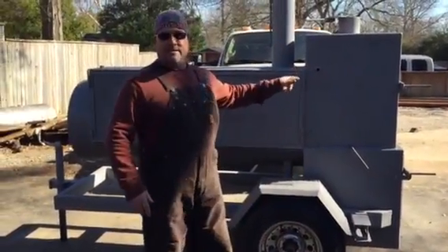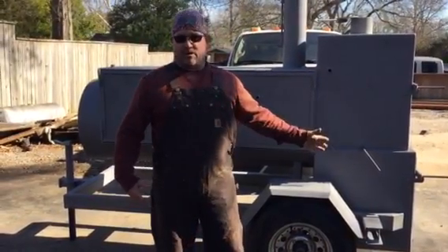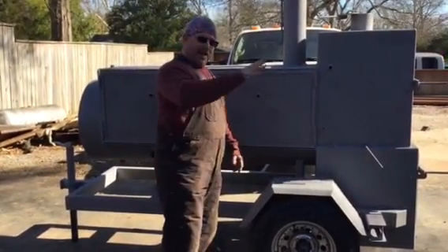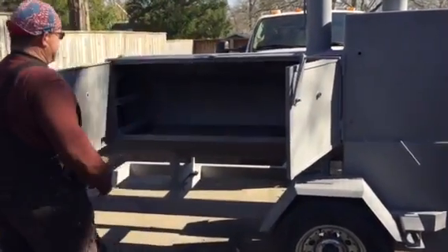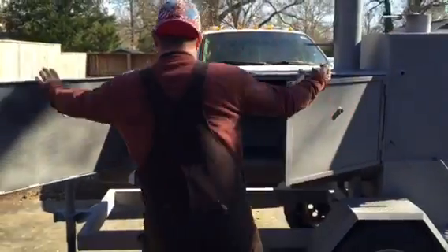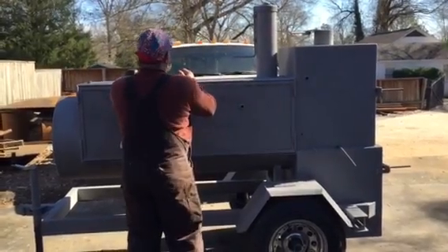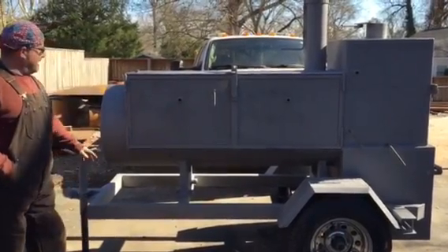This cooker has been sandblasted. A lot of people say their paint pops off — it's not the paint, it's the mill scale that the paint was going over. So it's the mill scale that pops off. Here's the inside of Joseph's cooker. Right here we don't have the grates — we'll get them built, no big deal. This cooker will be painted red like Chris's. This is upgraded with an insulated firebox. I do not advertise pricing — if you want one, you call me.